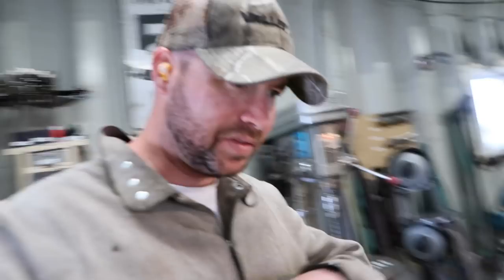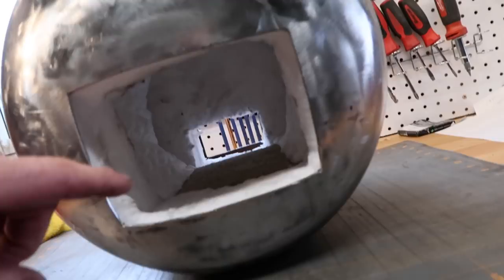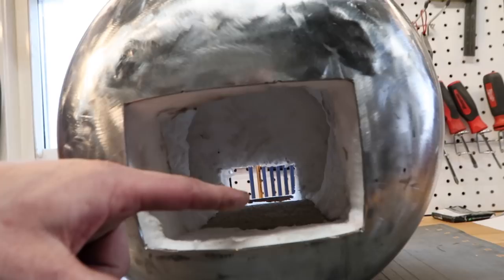So we've got all the wool put in there, welded back together, and I'm gonna start cementing the insides. So I've got one brick on the bottom, that's it. My theory is that if I need another brick, or if I don't know if I'd want another brick, I'm probably just gonna leave it like this, but I wanted it kind of level, so it's all nice and level, all the way across. And then we'll just start smearing all the cement in there, all up in here and all that. I'm pretty excited.